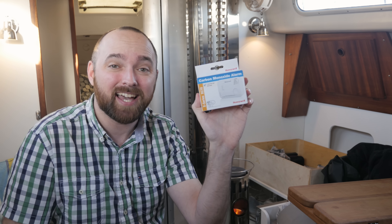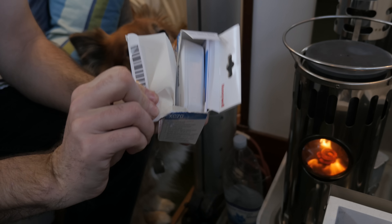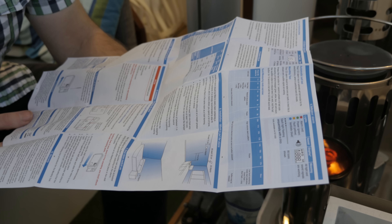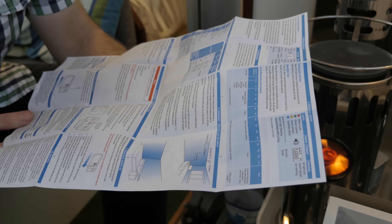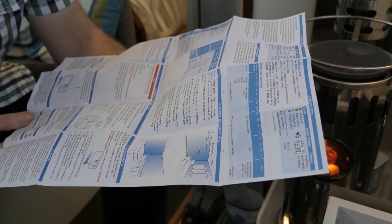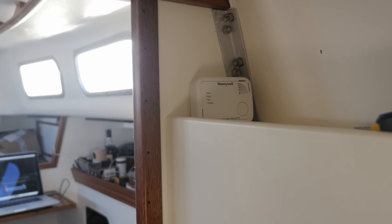Next up, something I should have gotten a long time ago: a carbon monoxide detector. It's a really good idea to have one of these aboard your boat, and especially here considering I'm using diesel to heat the boat. It is a little bit big, but at least I feel a lot safer having this aboard. Now I just need to figure out where to put it. Ideally an alarm should be fitted in every room — well that's easy, I only have one room. It should be located close to the ceiling at a height greater than any door or window — that's going to be difficult, but as high as possible. For now I've simply put the detector up on top of the tiny locker.